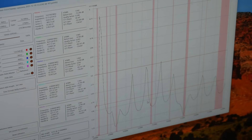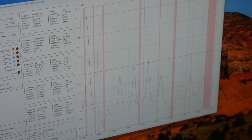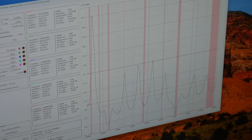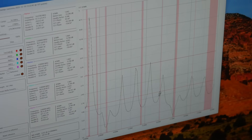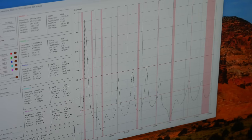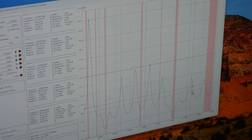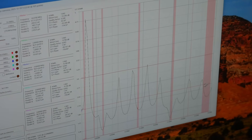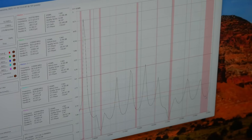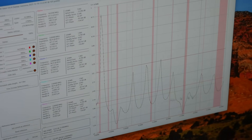If you were to change the location of it or change the other antennas in the yard, this could easily move and not be a good peak. But here it looks like it'll work just fine. On 17 meters we're right at 2.0 — you could tune that with your rig's tuner very easily. 15 is good, 12 is iffy but you could tune that down. And 10 meters — look at that — it's under two across the entire band and down to about 1.5 all the way across. So this is a single band antenna that just happens to pick up resonances on other bands.